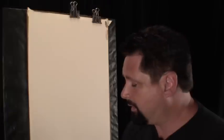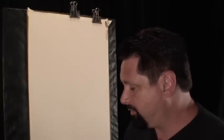Okay, let's get ourselves our glaze, most important thing. I'm going to use my Scumble glaze today. The Scumble glaze is an acrylic glaze, tints with pigment only, never paint, only pigment. Interior, exterior, cleans up with soap and water. And today I've combined a bunch of colors and I've matched it to a color from Sherwin-Williams called Saddle Up. So, let's get our things, let's get started.